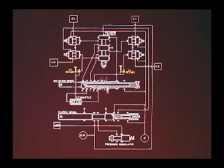There are 2 retard valves, one in the C2 clutch pilot circuit at the left and one in the C3 clutch pilot circuit at the right. The retard valves have the purpose of slowing down the release of the C2 and C3 clutches during shifting and are responsible for the smooth shifting characteristics of the transmission.